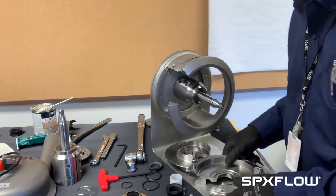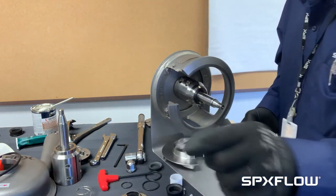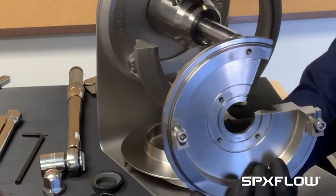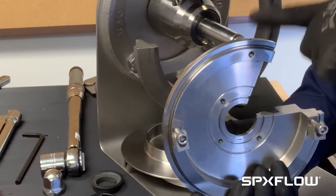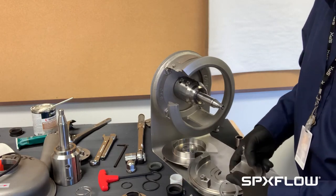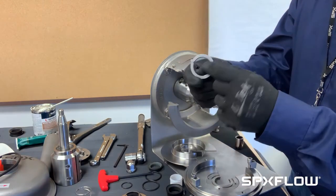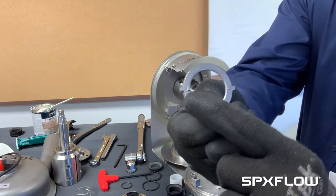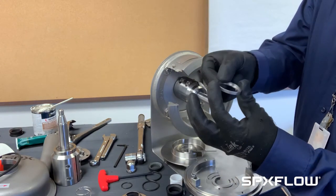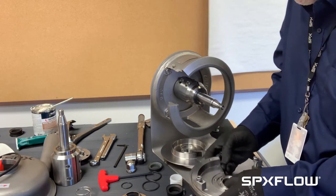Let's reassemble this. First, take the pressure ring — the tabs are on the bottom, they face down, because I am using this with a vertical output. I am going to align the pin up, then place the pressure ring with the tabs that protrude facing down. The groove in the top that holds the spring will face up. Notice these tabs fit in between the two mounting bolts.